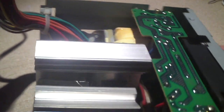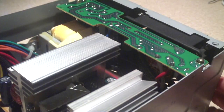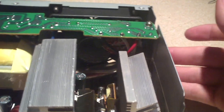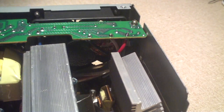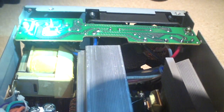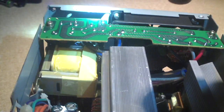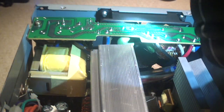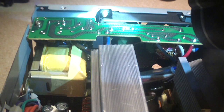This thing has a lot of hardware crammed in it. We have a primary board and a sister board — there's so much stuff in this thing. I'm going to grab my light so I can get some better light inside. The AC goes straight from the receptacle to this sister board that has some filtering stages and holds the fuse.